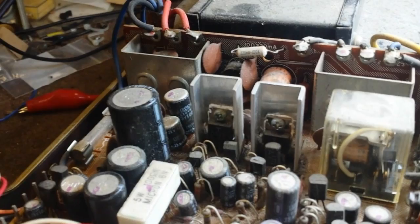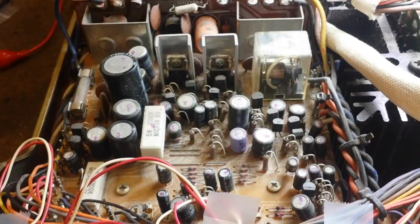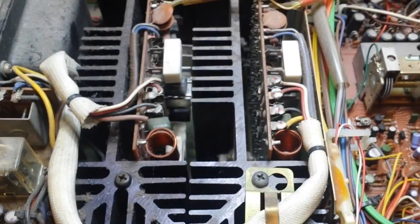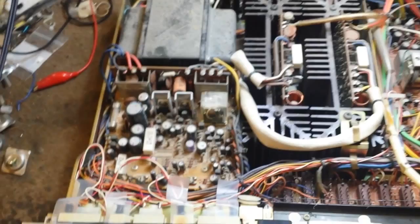Surprisingly, unless the machine has been in an environment with very little ventilation, the caps don't fail that often. We're going to check the ones next to the heat sinks because the wrappers are starting to shrink back, suggesting excessive heat. This protection relay will probably need to be burnished or replaced — it's a 12-volt style, not 24-volt. On the 2020 and 3020, the driver transistors on the driver boards can break loose at the collectors and cause all sorts of scary transients in the audio.